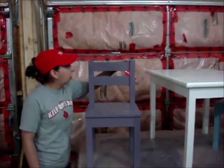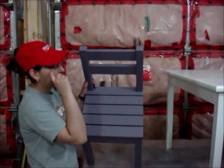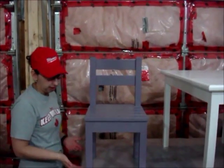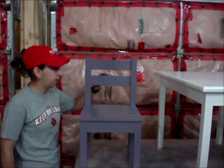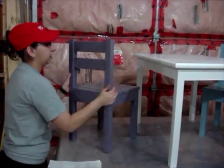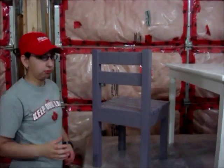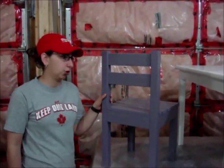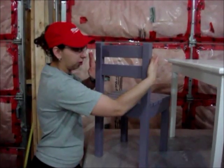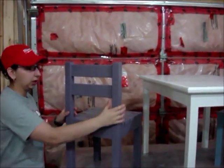For the top I didn't want it flush — I did a half inch drop behind, and in here it's just an inch and a half spacing. I left over a piece of the legs that had a little extra cut off, and I put one scrap piece in there so I could screw them together. I put a clamp on so it was nice and tight, then used the Kreg jig — about a quarter inch from the back. Once it was in position I could take the spacer out and just used pocket hole joinery to screw it in. It is nice and strong.